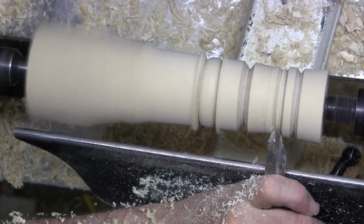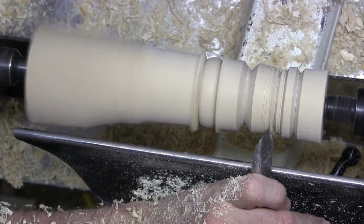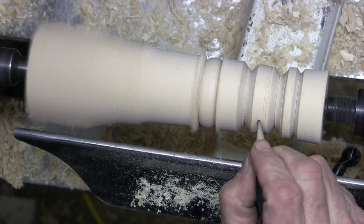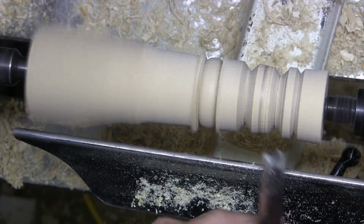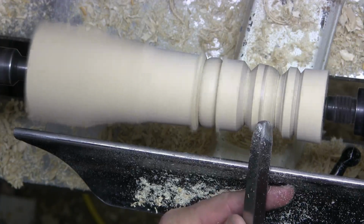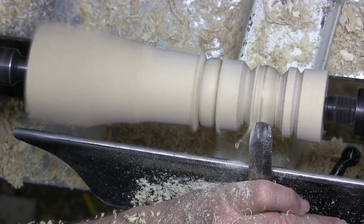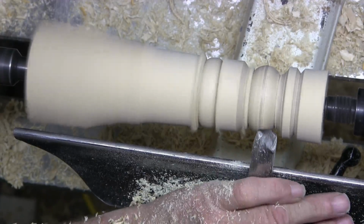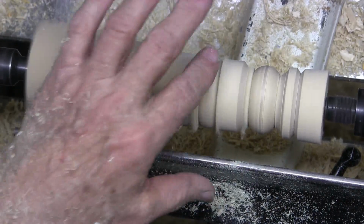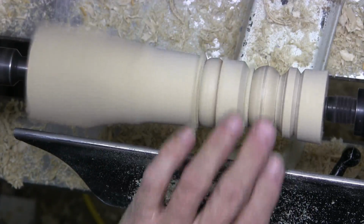Go ahead and lay it out with V-cuts. Then take a pencil and smear across the center. It's not a center line. Stay out of that. And here's how I'm going to do it that's different. Roll and roll, roll. This tool's just a little dull, but that's the idea. You actually take the short point and put it into the wood. It took me 2 cuts to roll that bead. This one took me 6 layout cuts and 2 per side. That's a total of 10 cuts.